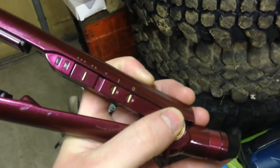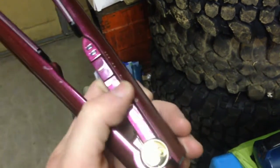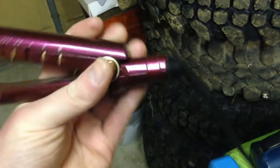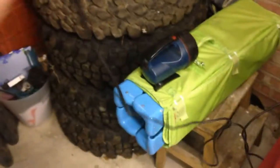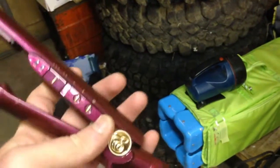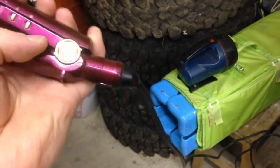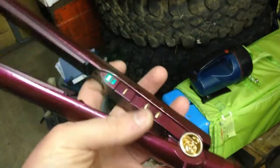Oh, hello. Okay. Working again. Oh, I know. These horrible bloody rotational connectors, which are a good idea, but they're a point of wear. Especially when you're tugging on them, trying to undo the kinked bloody flex, which is all kinked up now. Eventually it gets abused. So I think this one's suffering from worn contacts, or duff contacts from being abused too much. So it's powering on, and I can feel that getting warm.